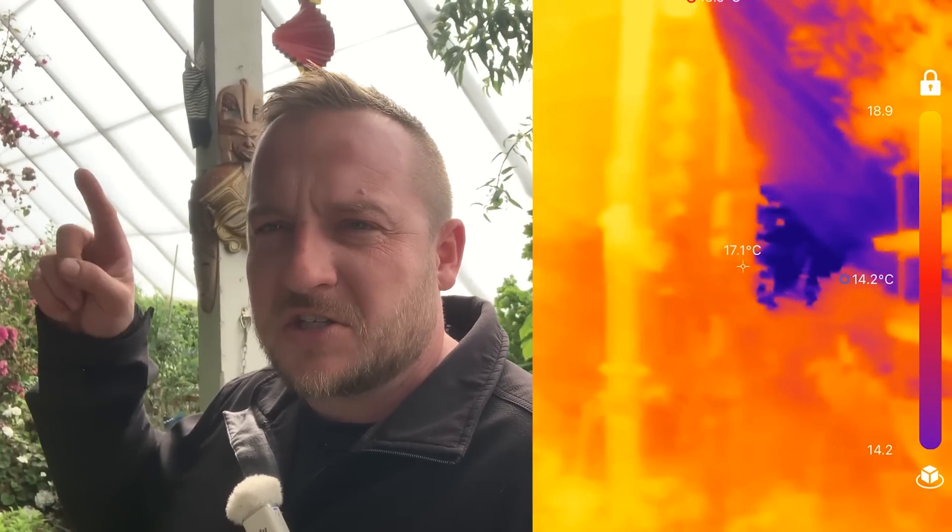Obviously all of your heat loss is on the glazing side of a greenhouse. This is twin-wall eight-mil polycarbonate on the outside with a six-inch air gap and six-mil greenhouse UV-resistant poly on the inside. That's the coldest spot that shows up on the thermal imager on cold nights, and it definitely picked it up.